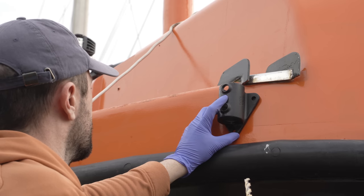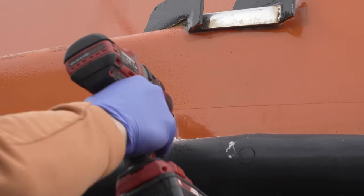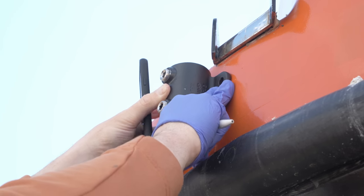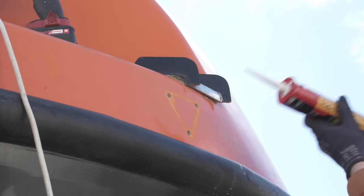I'm marking the first hole with a full-size drill bit first, then having learned lessons from the past, drilled the first hole, placed the bolt through, and then only marked and drilled the others then. I've found that marking and then drilling all the holes first tends to lead to a calamity of misalignment. Holes made in fibreglass — done.